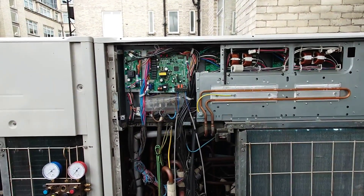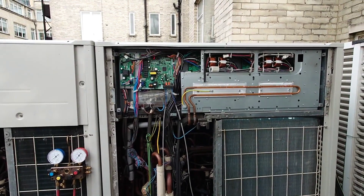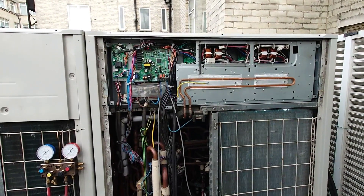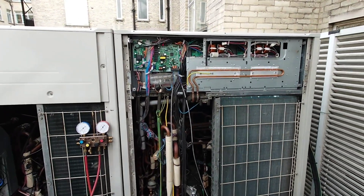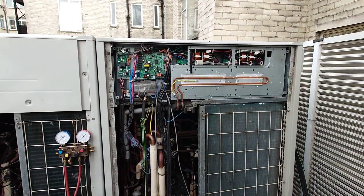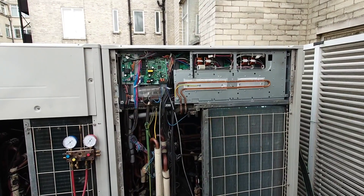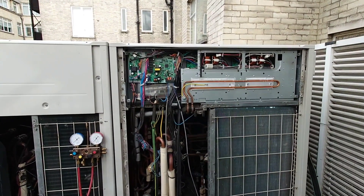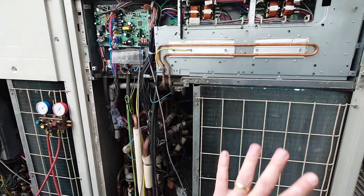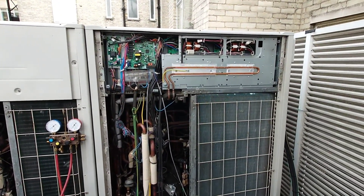We won't pull things apart now because the system's live — we don't want to be doing that just yet. The reason we're keeping it live is because all the valves are open in recovery mode. I think if you power the system down some of the valves might shut, so we're not going to do that. I want to keep the system live while recovering. Once we recover the gas we'll crack on with pulling things apart once everything's dead. And this isn't a DIY job — I wouldn't recommend attempting it if you've got no skill in HVAC. Leave it to the professionals. These are three-phase condensers — there's not a lot of chances with three phase, just bear that in mind.